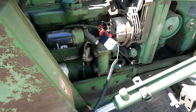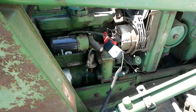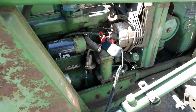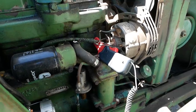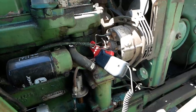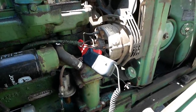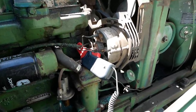It's charging, but it's not charging correctly. Only getting about 12.6 volts out of the alternator, and it's making about 5 amps at 1500 RPM — should put out 30 amps. I asked my auto electric wizard and he said it may have a problem that didn't show up on his test machine. He just full-fields them and tests for some output — it's not a true load test. So we're going to pull the alternator back off and probably replace it. It's kind of annoying because I took it to him so he could test it, and here we are throwing parts at it.